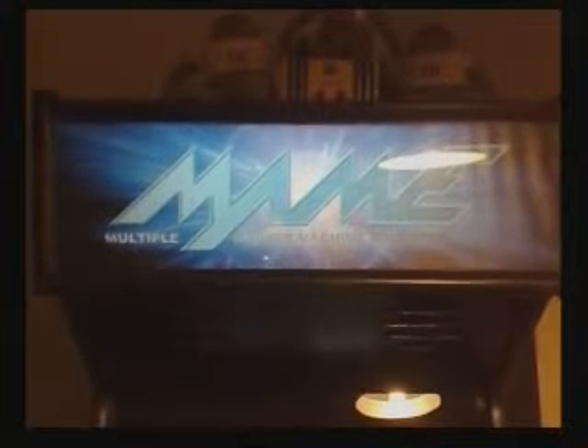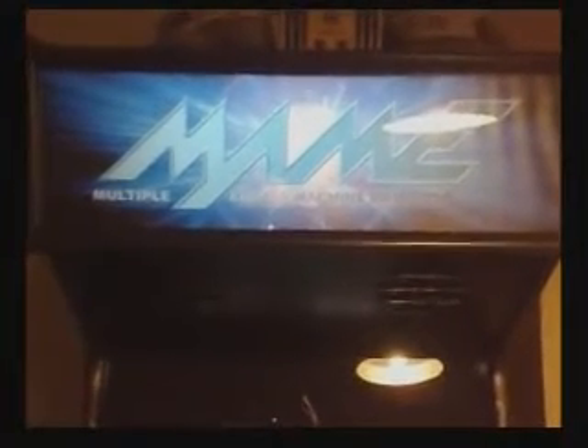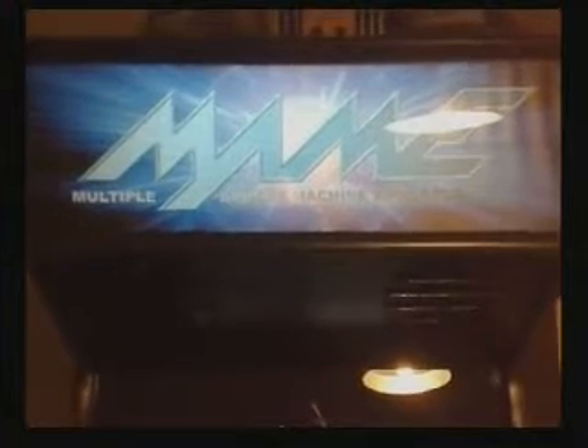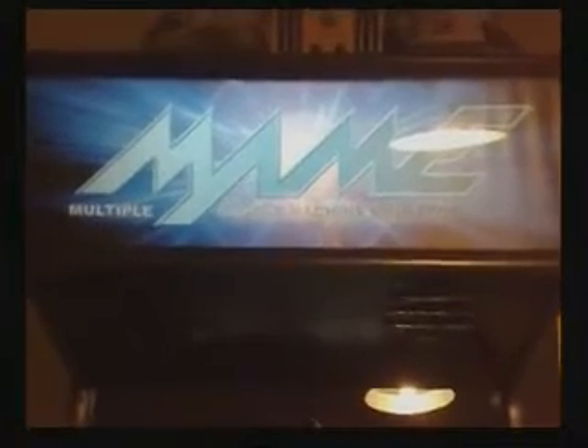All arcade machines generally had a backlit marquee, as can be seen here. I've got one that says 'MAME — Multiple Arcade Machine Emulator'. This marquee was printed by a company known as Gremlin Solutions, who actually print arcade cabinet marquees. It was then sandwiched between two pieces of plexiglass and backlit using a UV light, which you can buy from your local hardware store. Underneath are the speaker grills. These are called marquee retainers — they hold the marquee in place, cut to size and screwed on from underneath.